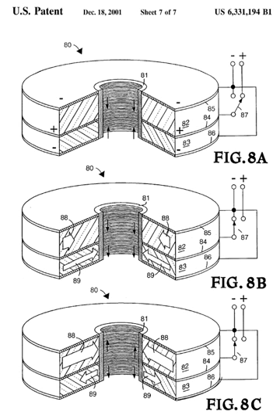The accelerator tube is made from sheets of fused silica, only 250 micrometers thick. After polishing, the sheets are coated with 0.5 micrometers of chromium and 2.5 micrometers of gold. About 80 layers of the sheets are stacked together and then heated in a brazing furnace, where they fuse together. The stacked assembly is then machined into a hollow cylinder.